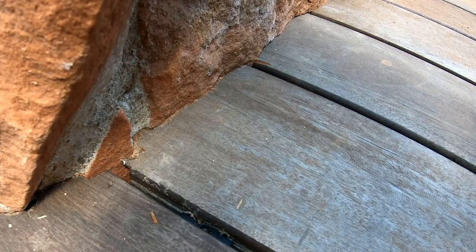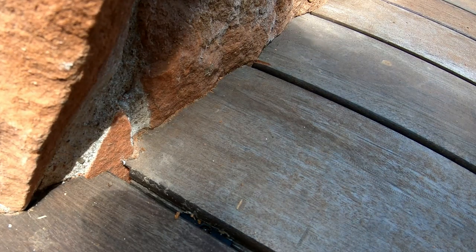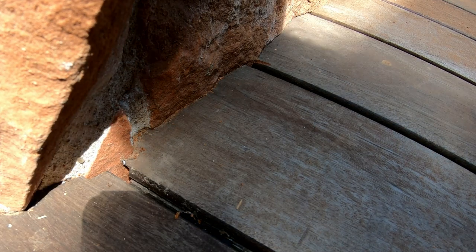All right, I want to show you how I'm scribing. Scribe fitting all these boards. I would call this like a level one scribe because I'm using power tools and I'm doing only a couple stages. And there's going to be very slight gaps, but this is a fast method and we can get the look we want at a 3 foot distance.